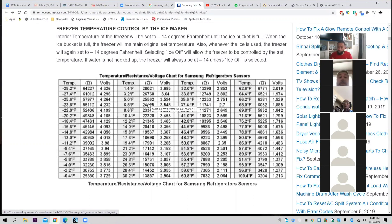When you check your thermistors, you use the charts to make your conclusions. What you do is you take your infrared gun and you point it at that temperature sensor and you get a temperature reading. You take a few readings — it may say zero, one, or five — and then you go for the median, somewhere in between what your temperatures are giving you in that vicinity. Once you have that, then you come over to the chart.